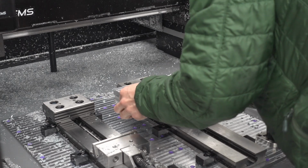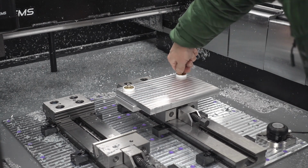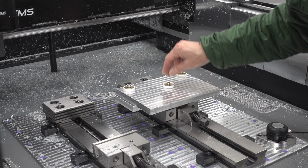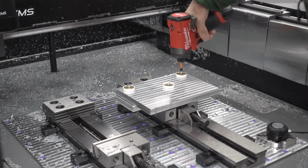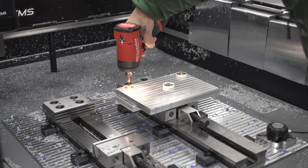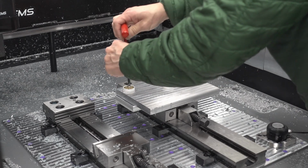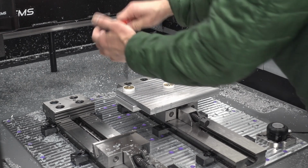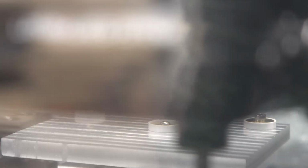So basically there are two holes at the top, and then there's the hole which is offset below that toward the center. It's a little bit offset to the right. And that hole needs to fit, the screw on the bottom actually is an M5, so that needs to go through an already threaded hole, which is an M6.